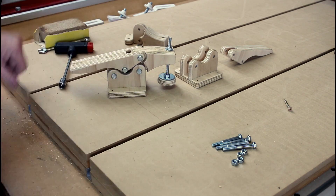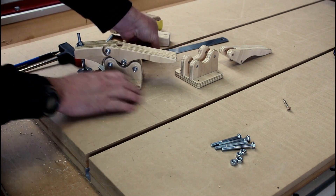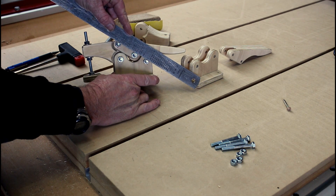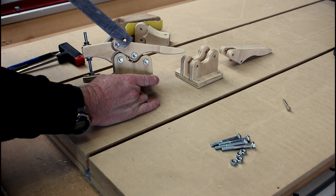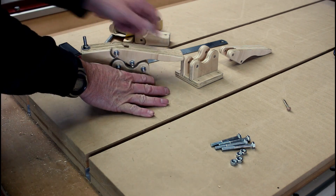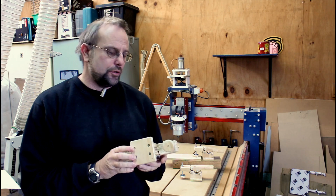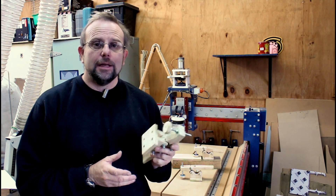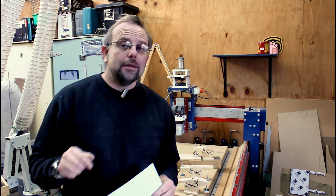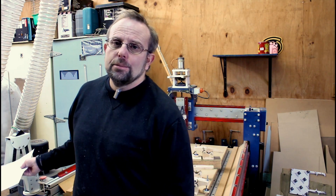If I'm wrong I can quickly drill a hole and add that in. One of the critical parts of this design is these two bolts - when it's in the lock position they must be higher than the center bolt. That center bolt is about 1/8 inch or 3 millimeters lower than these two outside bolts, so the clamp will lock properly and no amount of force will allow that to toggle back open. There we have it - the completed toggle clamp. I'm really looking forward to putting this to use around the workshop. Thanks again to Izzy for designing and allowing me to reproduce this project. For those looking for plans, I'll put a link in the description box below where you'll find printable plans as well as CAD drawings. If you've enjoyed this video please be sure to like it. Thanks for watching and I'll catch you guys later - cheers.